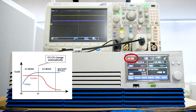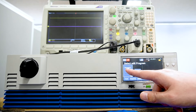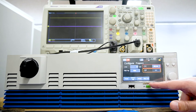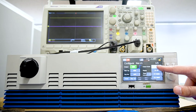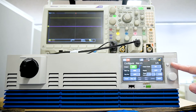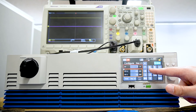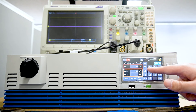Finally, let's look at the sequence operation of pulse charging-discharging in DCSIM mode. We create a charge-discharge sequence using DCSIM mode with 30 cycles at 0.5 second intervals and a current of 5A. We set the voltage value to 14V, which is higher than the battery voltage. This way, the DCSIM mode can be used to create a pulse charge-discharge sequence.